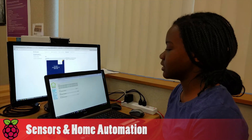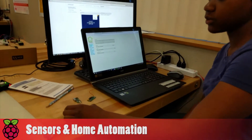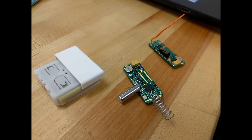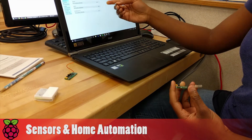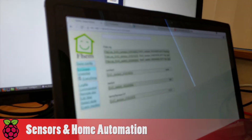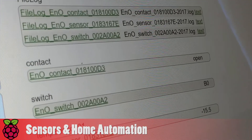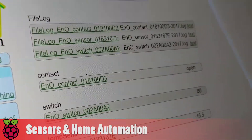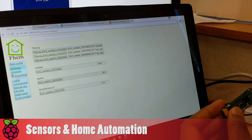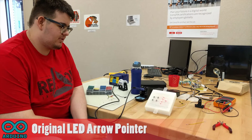My project was a Raspberry Pi with two types of sensors and a switch. The first one is called a contact switch. Based on its distance to the magnet, it shows on the website as either open or closed. When it gets close, it shows as closed, and as it gets further, it shows as open. The way this would be used is on a door — you put it on the door so every time the door opens, it shows on the website that the door is open.